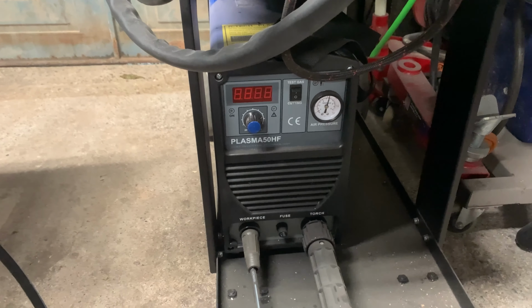They're Banggood specials, so they're not amazing quality, but they do last fairly well. I've got to give them that. So yeah, we'll knock these out and see what the hole saw does for us. Just slowly, slowly. Now that won't go all the way through because the step is less than the thickness of the steel, but that should be fine. It's an 11mm drill, see how sharp it is. Not too bad.